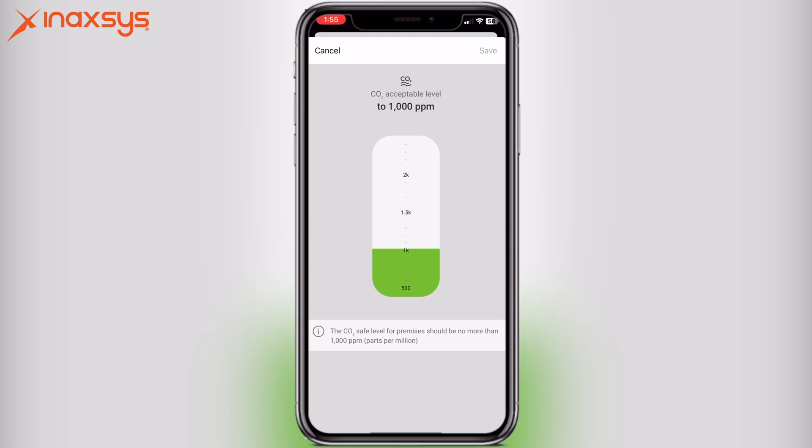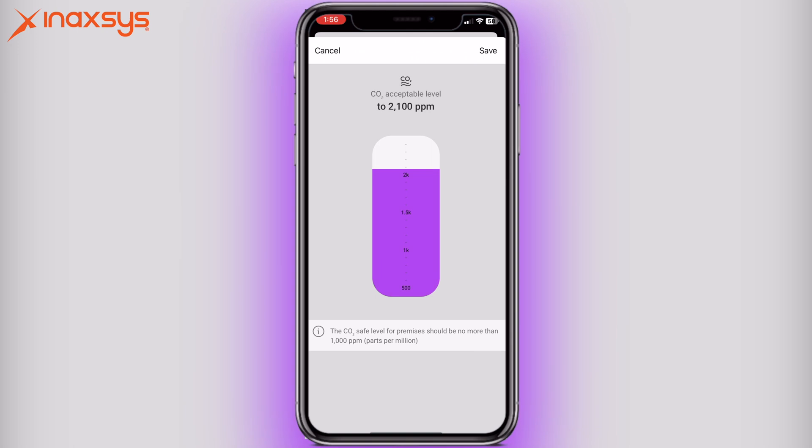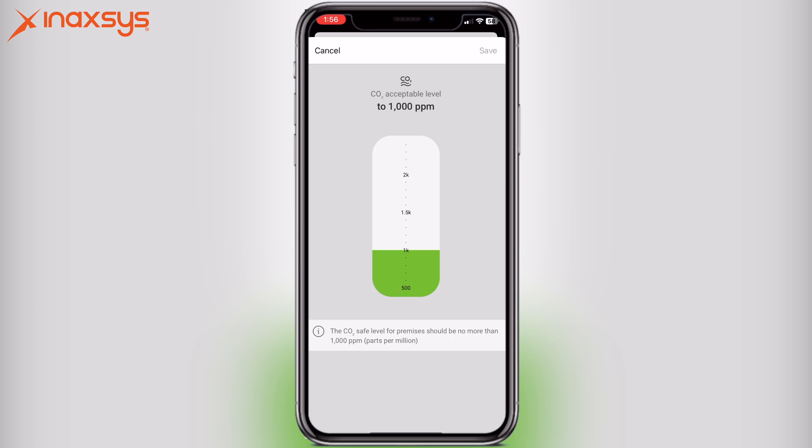As people start getting drowsy, our thought processes are reduced. As you can see, as you start to get into the yellow section — at about 1,250 parts per million or above 1,200 parts per million — all of a sudden it goes into yellow, meaning the air quality isn't as good. Above about 1,400 parts per million, it turns red — this is the danger zone. And if it gets too high and turns purple, this is actually dangerous for people's health. So I set the alarm at 1,000 parts per million.